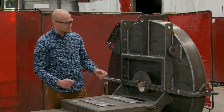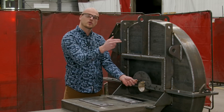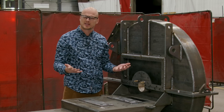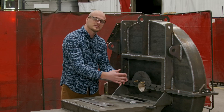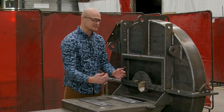This one is center-supported and it also has a custom shaft seal with a purge port up here, so that you can run purge gas — something like nitrogen or plant air — that will create a positive pressure in that shaft seal to keep the hot gas in and keep the cold gas out.